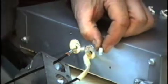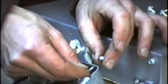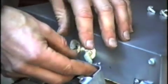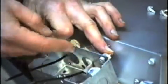I'm going to put these sheet metal screws through the box into the holes here, but I'm going to put a spacer on there which is actually a quarter inch nut. There are two reasons for that. The first reason is that it means that the electrical box isn't touching the kiln lid, so there's less heat transfer into it. The second reason is that the cover plate for the electrical box has a bit of a lip that curves over the edge, and moving it away from the corner of the kiln means that it just fits a little tidier.